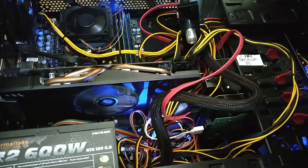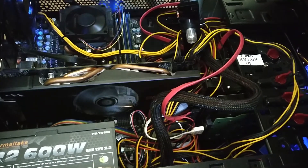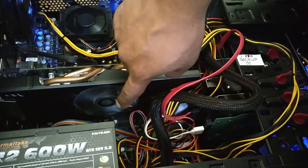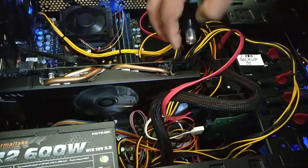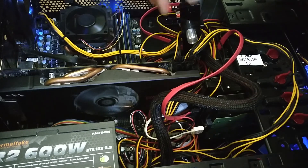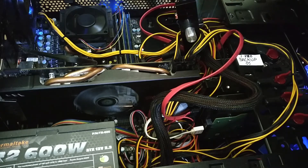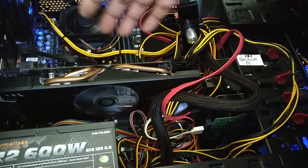Right now it's all off — let me turn it on. There you go. The fan is running; it boots up and briefly turns off, then comes back on. As I increase the knob the fan speed increases, and as I decrease it the speed decreases. The ATtiny85 is generating a PWM signal controlling the fan speed. At full speed you can actually hear the fan — that's maximum speed. When gaming I turn it all the way up, and for normal browsing I set it around 50% or 25%, which is enough to keep it cool and prevent shutdown.